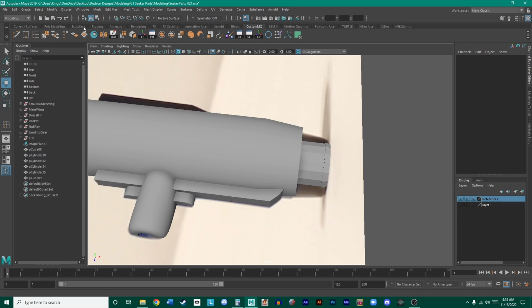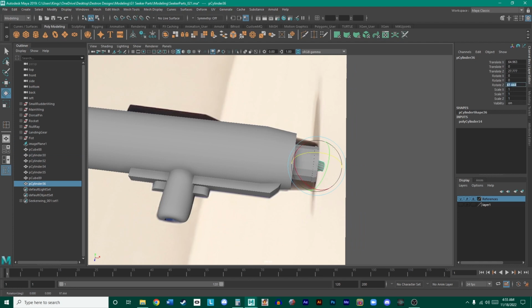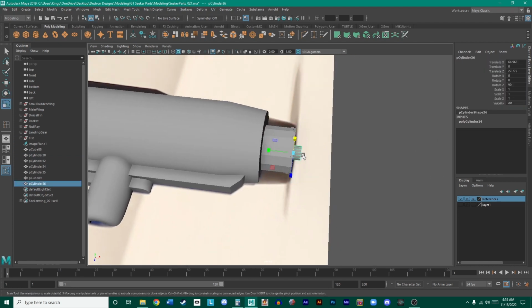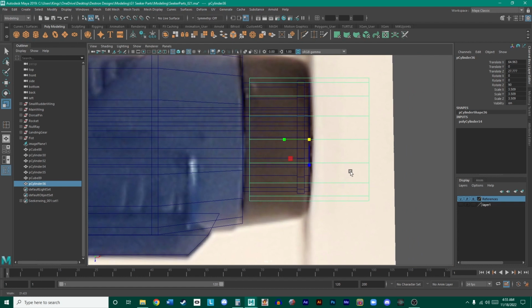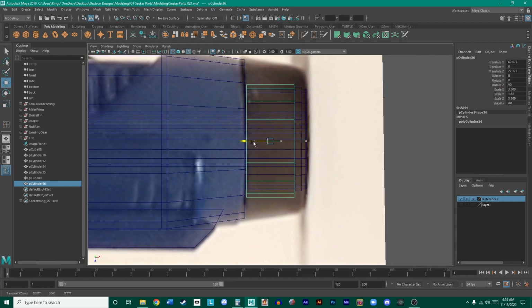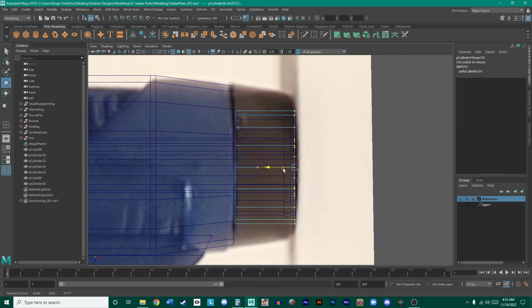Our cap is going to be very similar to this in the way that we have it. Turn that 90. Let's grow this guy. Yeah, it's on the 0. That's good. Alright, let's flatten him out. Try and do our best to kind of line him up with this guy. I'm going to just measure this just because I like measuring. Even though it's a tapered shape, I still want to know exactly how wide it is. Alright, we're looking at 9.2, I'm just going to say 9.26 millimeters out here.